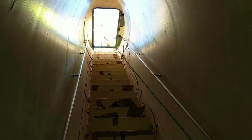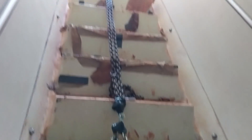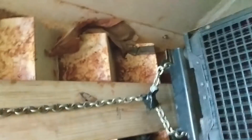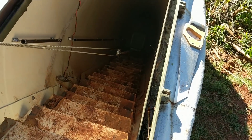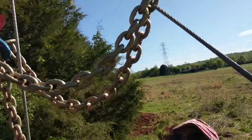We've got our high lifter jib connection with our cable down to our generator. The trickiest part will be getting it up here, and hopefully she'll slide right up. We've got the generator pointed in the general direction of removal. We've doubled up our cable so we have twice the pulling power using our snatch block. She's way down there — about 28 feet underground. Good thing we doubled up — I guarantee it.